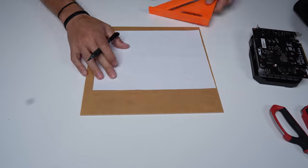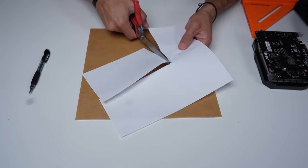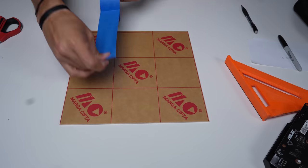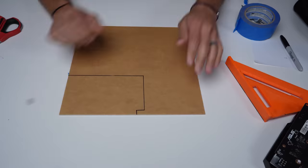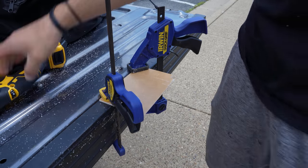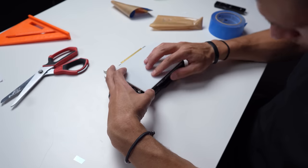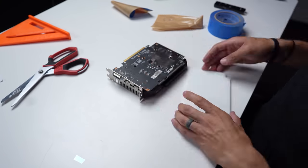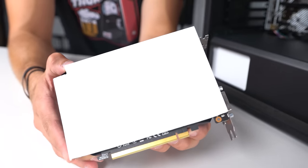This only costs about $10 extra into the build, and I think I'm going to do this from now on. Here's how I did it: first, I created my own stencil with a piece of paper, tracing out the PCB — the backplate just needs to trace the outer outline of the PCB. Then I transferred that stencil to a 3mm white acrylic sheet, which you can buy on Amazon for $20. I'm only using half of it, so there's an extra sheet for the next build. Then I cut it with a jigsaw out in my truck. Finally, I installed some double-sided tape on the screws — I wouldn't recommend taping directly on the PCB, but going on the screws should be fine. I'm really happy with it, though I feel like it needs some sort of sticker for more contrast.